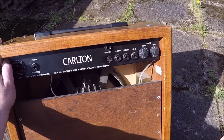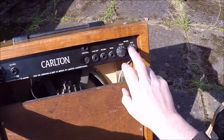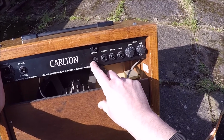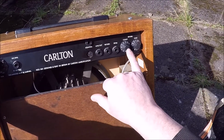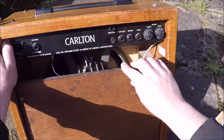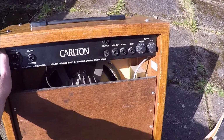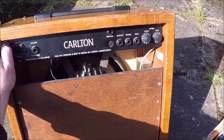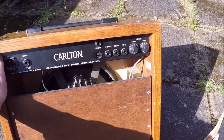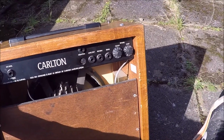The guy said he tried sticking a Marshall foot switch into it and it didn't do anything, but I wonder if it maybe turned on the reverb. Oh, that could be the fifth pin, couldn't it? Wouldn't that have been very clever if they'd managed to make it so you had reverb on and off, and then the lead presence, preamp 2, and boost things on a foot switch? A 5-button foot switch, that'd be pretty cool. No, because you'd need to have a return, so there can only be four.